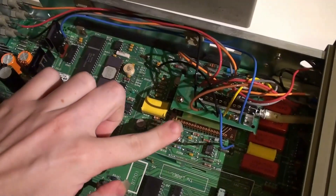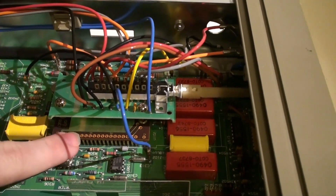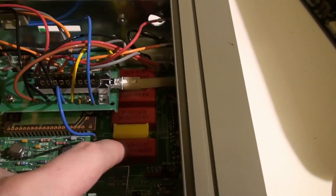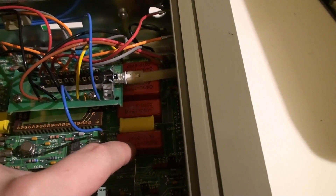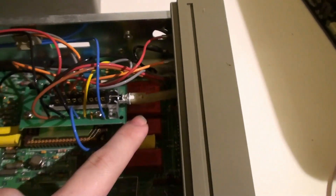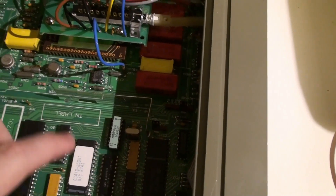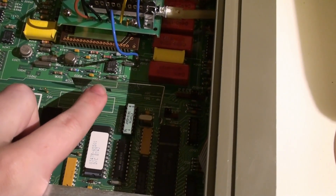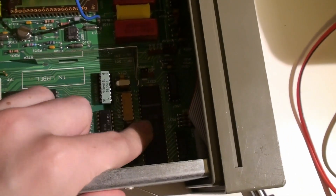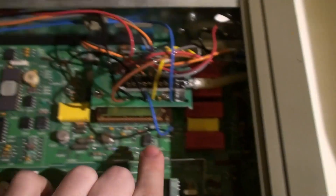The HP 3478A has probably all the features you would need. It has a decent voltage reference, a nice input hybrid, and these really nice shielded relays — they're probably small signal relays. According to one of the designers of this multimeter, this shield was needed in the prototype but not in production, because the first processor they used was noisy.